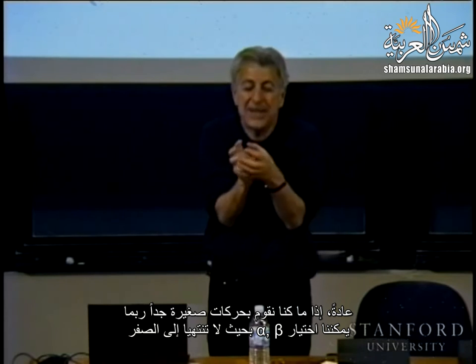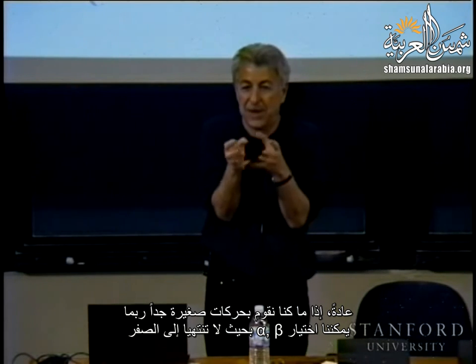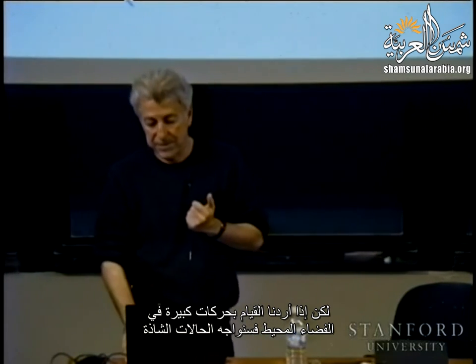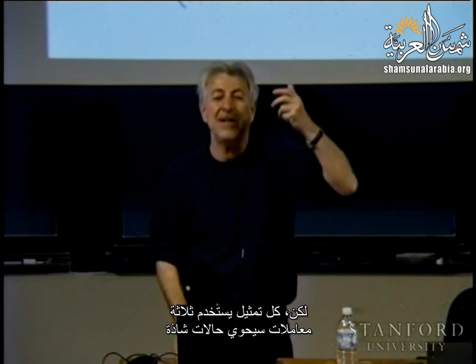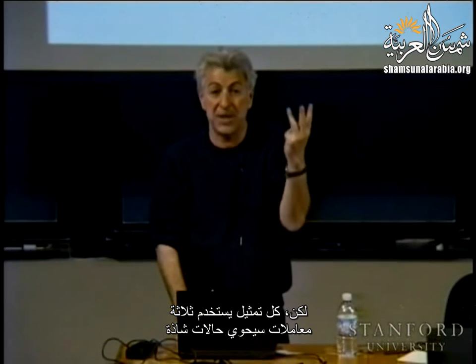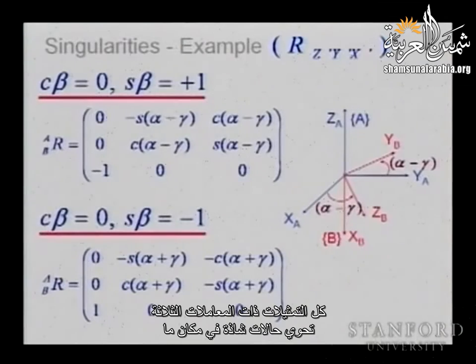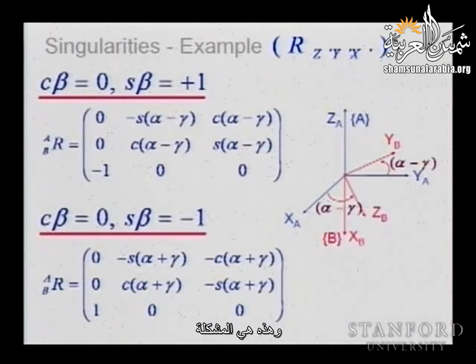Usually, if you are doing a very tiny motion, you might be able to select alpha and beta so that they will never go to zero within that small motion. But if you are performing large motions in space, you are going to run into the singularities. Now, we can change representation, we can use another one, but every single representation that uses three parameters is going to run into a singularity. All three parameter representations will have a singularity somewhere. And that is the problem. So,